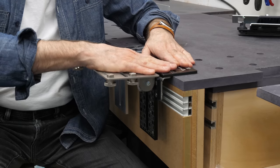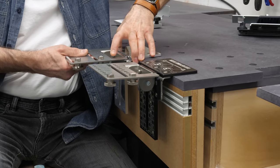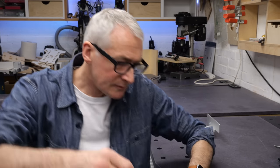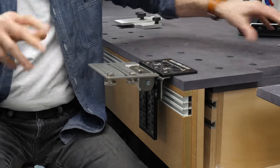The difference between the prototype and the shipping version principally comes down to the size of the top plate that the guide rail attaches to — it's a little bit smaller in the shipping version, about 25 to 30mm off the guide rail plate. This just attaches into the dog holes and locks down very tightly. That's a big deal if you're someone who works off a regular MFT top on trestles or on a centipede-style support.